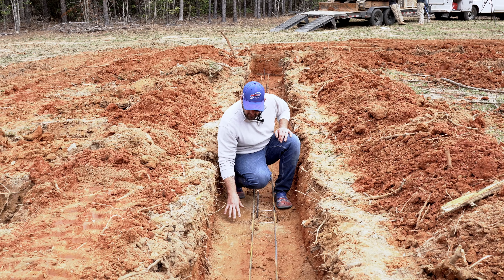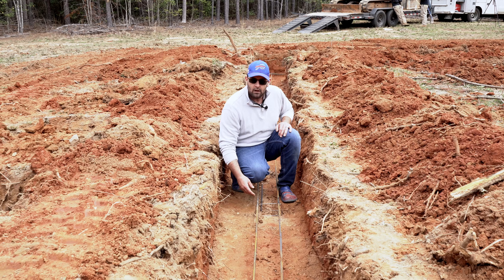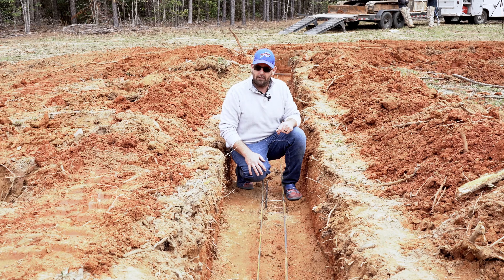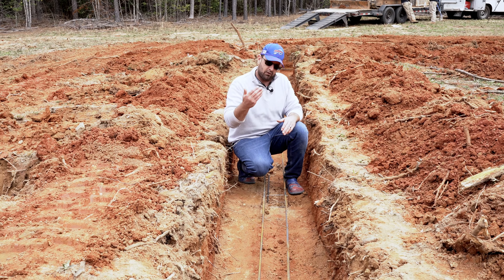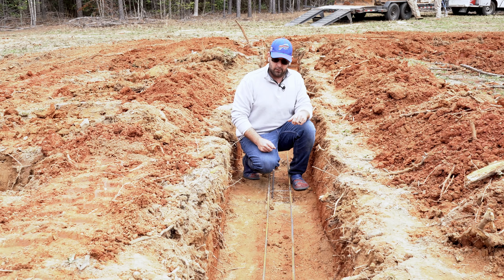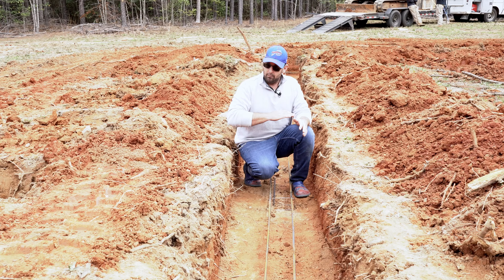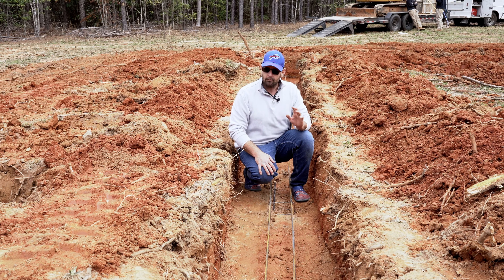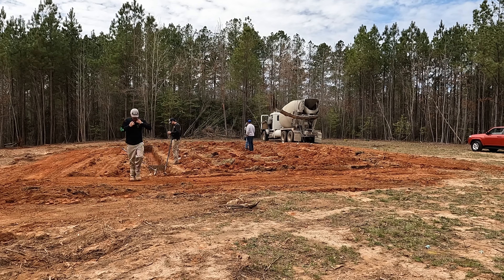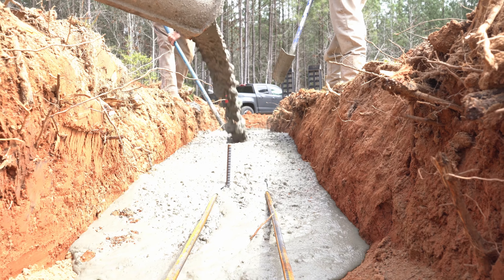We're going to have about eight to ten inches of concrete, with all these height markers perfectly in line. This helps keep the footing at a good height so the brick layer or foundation workers won't have to rip a bunch of brick material height-wise — they can just install some mortar, place the block, and go. Much cleaner, much nicer for the foundation guy, and really an essential part of the footing process.